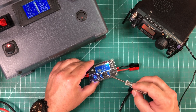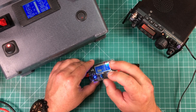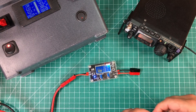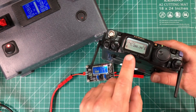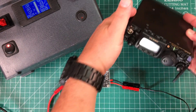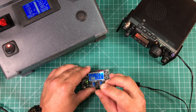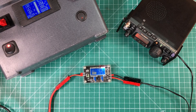This potentiometer adjusts the current. I have no idea what the current is at or whether the BMS inside the battery adjusts current, so I'll back it off a bit first. I have a WindCamp battery with a PowerPole connector plugged in. Plugging it in — it's working! The battery was at 11.5 volts and now reads 11.7. That's fantastic. The battery is mostly charged so it's only taking about 1.3 amps right now, but that is proof of concept — it works.